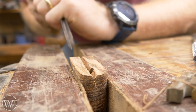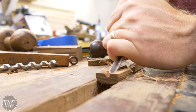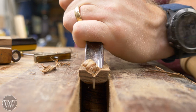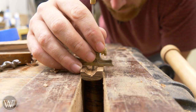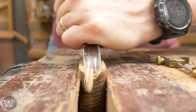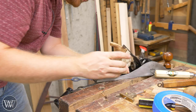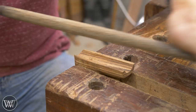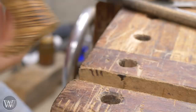Next I want to create a groove on the bottom that fits into the plane. I had the saw and cut that down to depth — that is my stop line that I'm going to cut down to. Then I come in with files, starting with a v-tool getting down close to that depth, then widening out the v-cut with a gouge. This gouge is a slightly smaller circumference than what I need, but this will allow me to get it close, check it, go back, adjust it again, get close, and check it. I can always widen it out with the gouge and work on the sides, then come in with a file to clean it out and do our final tests.